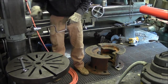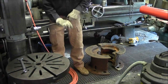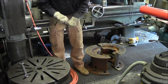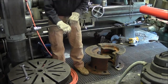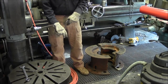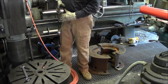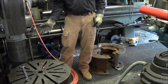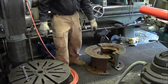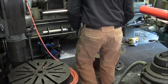This tooth right here and the one next to it, I had to rebraze. Those were missing, they were broken, and I reshaped those in. Some of it with a gear cutter in a diametrical pitch, and some of it I had to hand shape. Now I went down and then came back up slightly to keep the load and everything else on the forks on the lip there, and we're lowered down enough that we can go ahead and slap one of these up there.